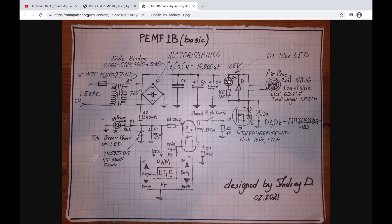We also have a pulse LED — it's a blue 2.5-volt LED with an 18k ohm current-limiting resistor in line. Anytime you activate the switch and power goes through the coil, this LED will pulse at the same speed that your pulse width modulator produces.